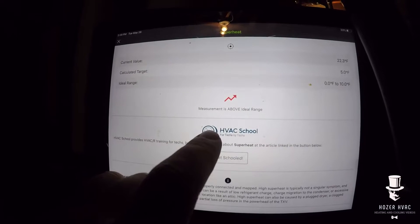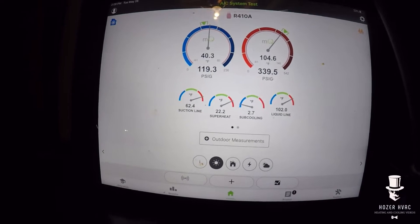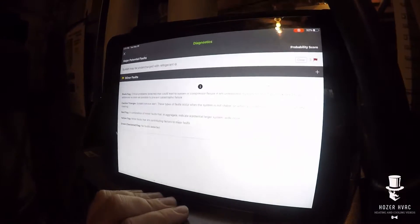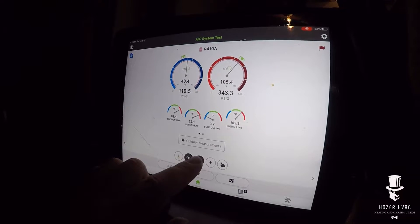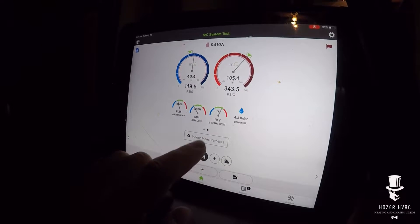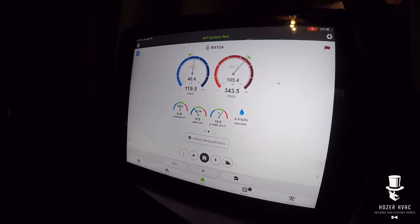The one thing I did notice is the superheat is a little too high — so we need a tad of juice to balance this unit out. It's probably never been balanced, to be honest with you. I'd say we're undercharged a bit. Our superheat is a little high, so let's get it down. My indoor load is pretty low — 58 wet bulb, 70 return — and it's cooling and purring quite nicely.